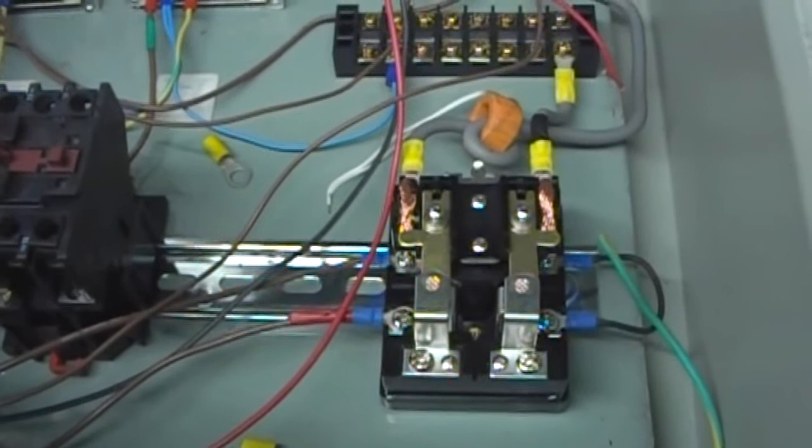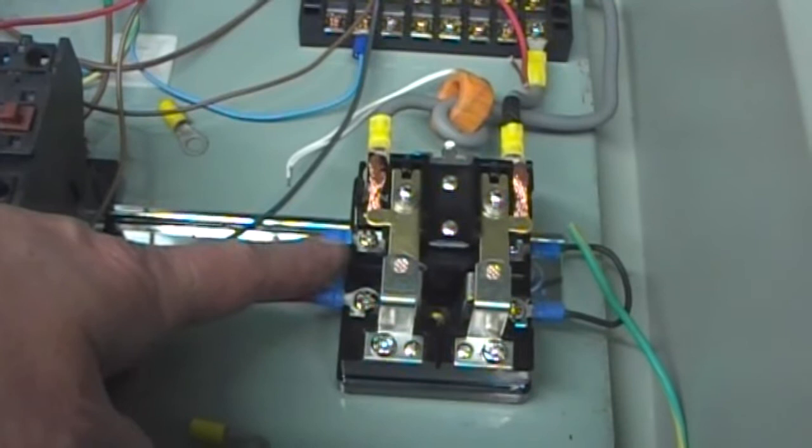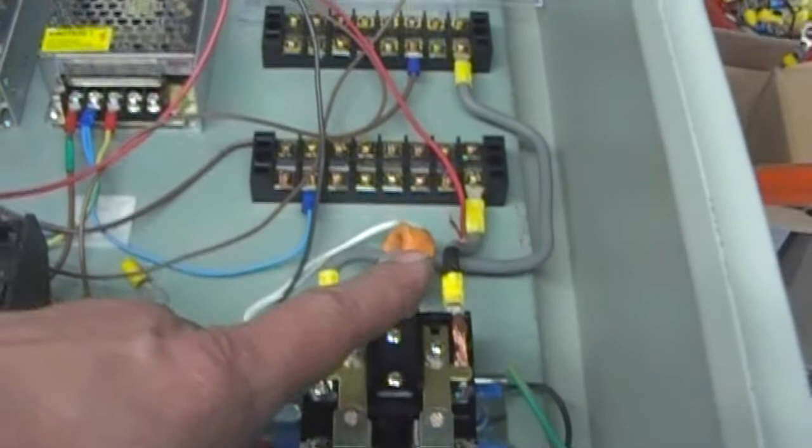We've got the double pole 80 amp incomer, which as you can see I've now started wiring the switching circuit, so the live in through the switch and feeding down to the coil, which energizes and pulls the contactor down, supplying the power through to the main cables which go to the live and neutral buses.